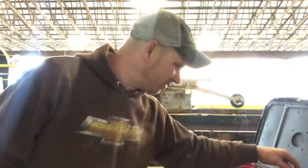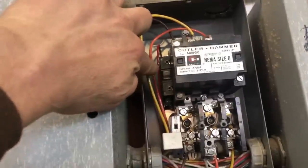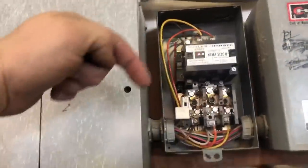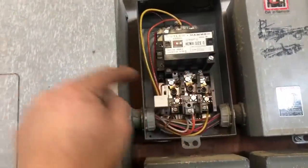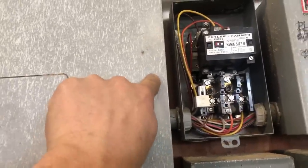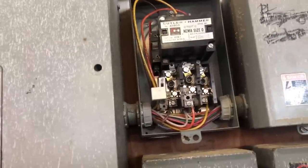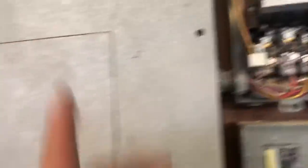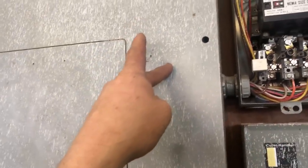It actually had a wire issue where I told you it was started. This red wire that goes to the top side of the auxiliary contact goes to your stop button — that's always hot. When you want to shut the motor off yourself without an overload, you push the red stop button. When you push the red stop button in, it opens that contact, and then you lose voltage to your coil, and then your spring pushes back out and your rig shuts off. So your buttons down there are momentary — your start button's a momentary hot, your stop button's a momentary cold.